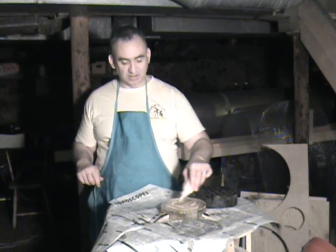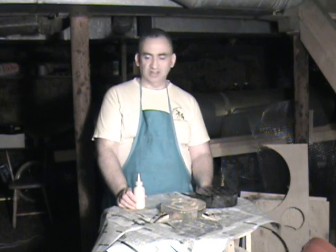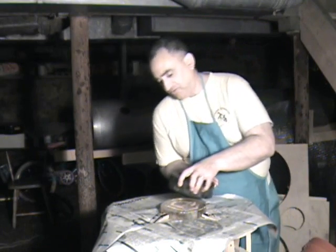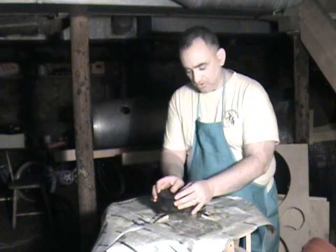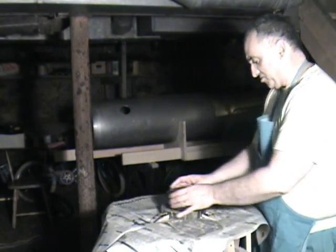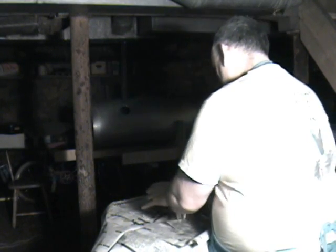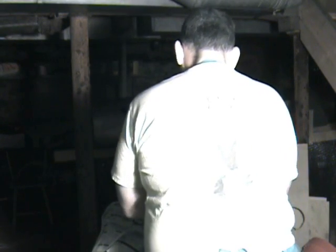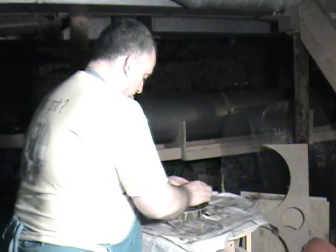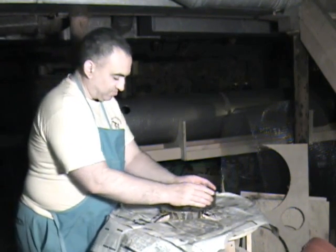I'm hoping to polish for about 15 minutes. The way this is going, after a total of maybe 2 to 2.5 hours of polishing, I should be completely polished out to the edge. I've rinsed off my cerium oxide, put some more on top of the optical flat, and I'm going to turn the pitch lap over and just go back and forth. You'll notice I didn't micro-facet this lap — there are different theories about that, and I don't see any real need at this point. Cooling off the pitch lap makes it a little bit harder and better able to polish. Too hard and you risk scratching your work; too soft and you're not going to do much polishing at all.